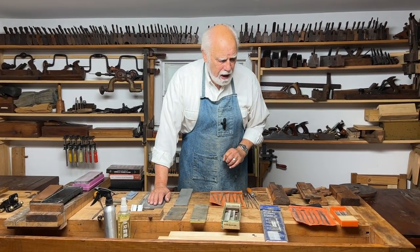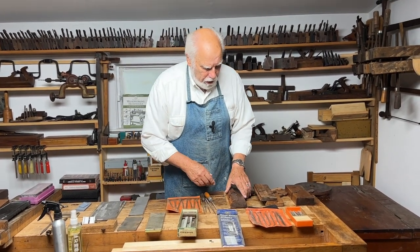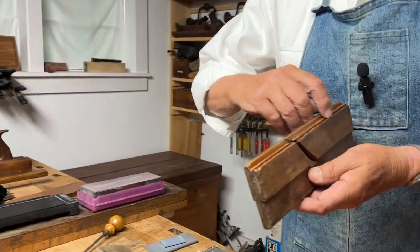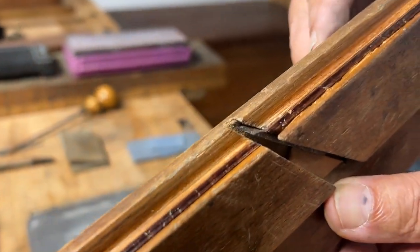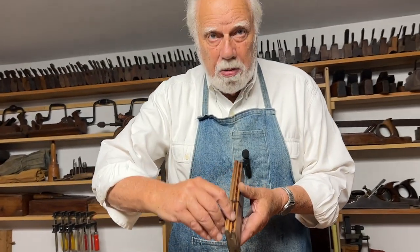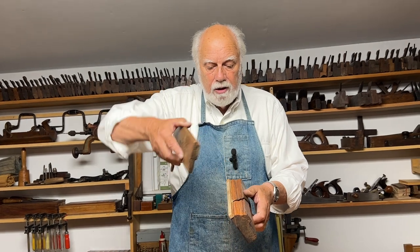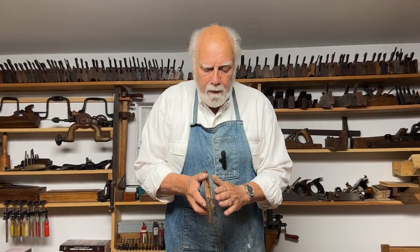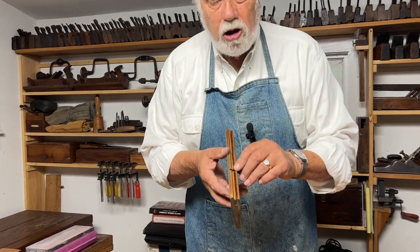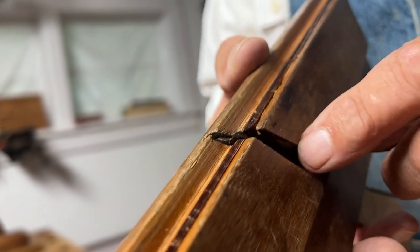Now, when you're sharpening something that is curved, I'll start off by showing you on these molding planes. This is a very, very old — over 200-year-old — molding beading plane. And the secret, whether it's a simple beading plane or a more complicated OG plane where the blade does all kinds of things, is that the first thing to do is to establish that the blade — properly called the iron in woodworking parlance — matches the sole of the plane.